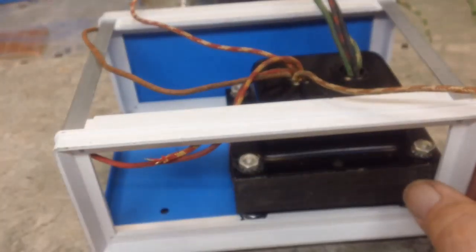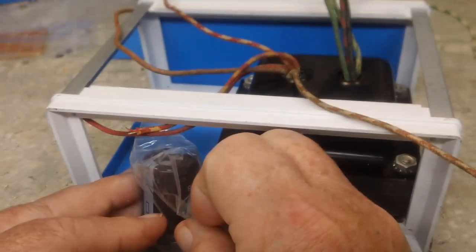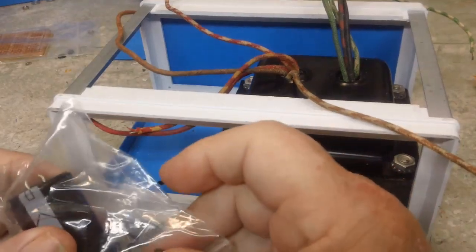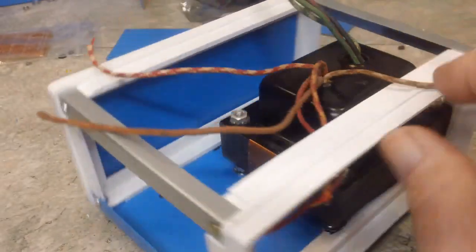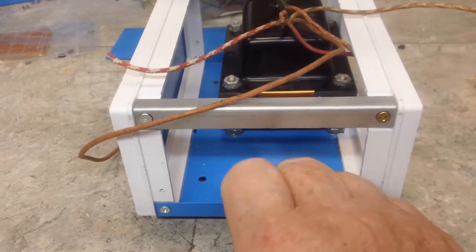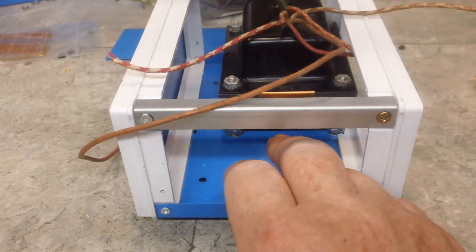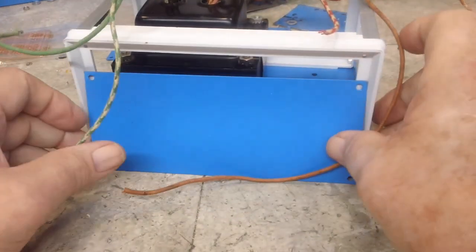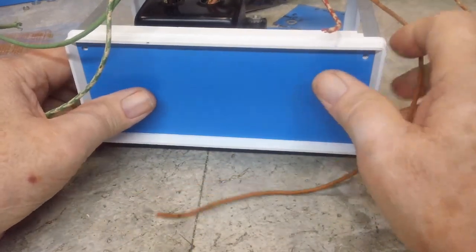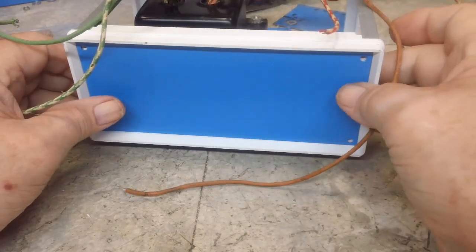Now, again, this can be mounted almost anywhere. I can mount it like this, up, and obviously I don't want it available to be touched unless it's off. Also, I have reconsidered, there is the diagram. I don't know that I'm going to ground the center lug or use a two-prong cord on this or not for sure, partly because of the potential between the output, if it's up high, and the case. In other words, if I'm plugging something in and just happen to touch the case, I could get 300 volts right there, and I don't really want that.